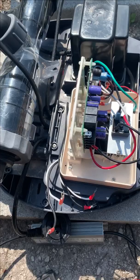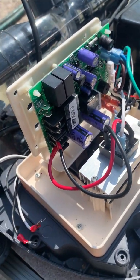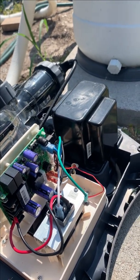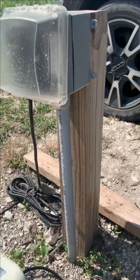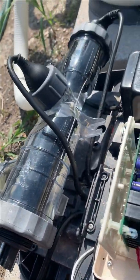I found something that I think is going to work. I've been messing with the circuit board trying to direct wire it and everything, because I keep getting the low salt warning. It'll run for a few minutes, and I get low salt. I found this little thing — I believe I got it on Amazon, I'll put a link in the description below. It basically converts AC to 12 volt DC, which is what runs these cells.